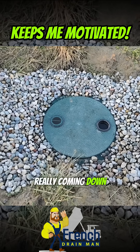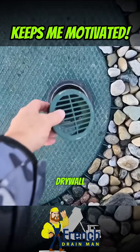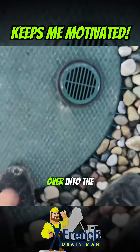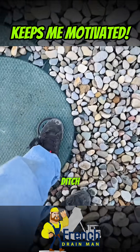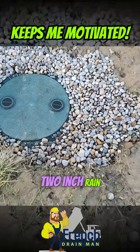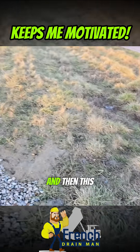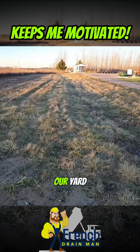I just wanted to make sure that if it was really coming down, the system kept up with it. So this was just a way of venting the dry well so the water can just pour over into the ditch. So there are the results — how did it work on a two-inch rain? It worked really, really well. The only thing that's wet is just the bottom of that swale, and then this goes to a detention area in our yard.